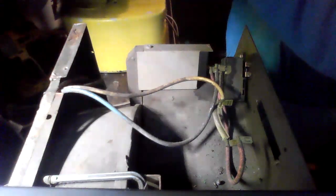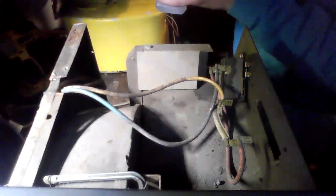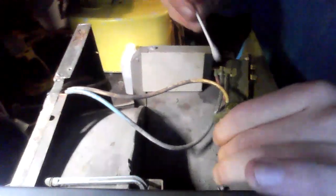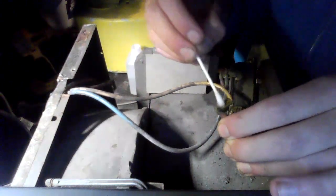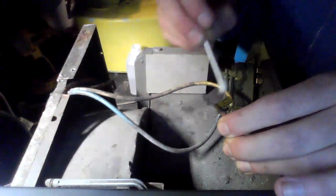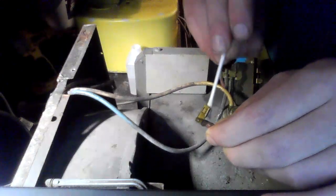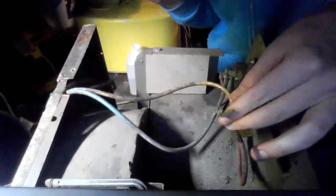I'm going to bring you guys right here so you can see this better. There are our wires right here. We're going to do the same thing as before — take a Q-tip, dip it in rubbing alcohol, and gently wipe each terminal to clean it. Just dab it like this. You can see it takes the dirt right off.